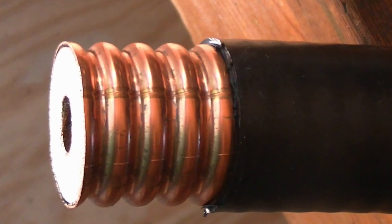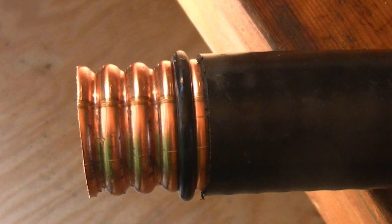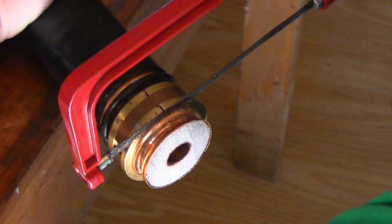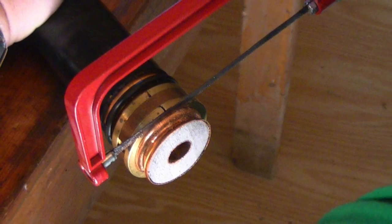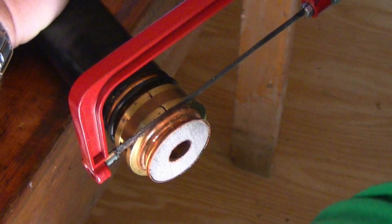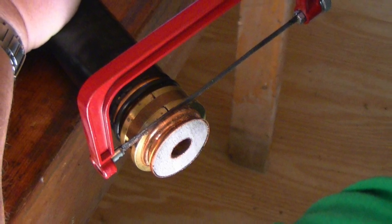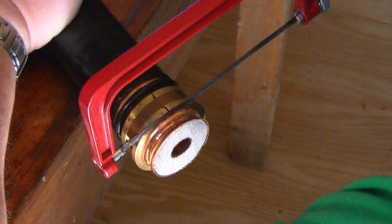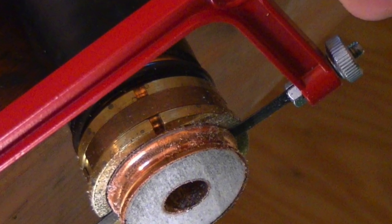Using the razor knife, or better yet your hardline prep tool, expose the copper shield. The exact measurements change with the hardline size and type and brand of connector. Expose the amount of shield and install the O-ring, followed by the compression ring. With the ring in place and a gentle action on the hacksaw, cut the end of the hardline off clean against the clamp.